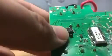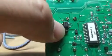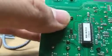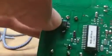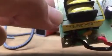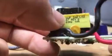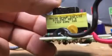Beautiful board. Over here, we have the very, very low power bridge rectifier, and that's just saying they're converting the AC that's coming in over here to DC. Top side, we've got a looks like a pretty standard silicon steel power transformer here, rated for 115 volts, 60 hertz, 1 volt amp, so approximately let's see, that would be 0.707 watts. So this thing's very, very low power compared to a lot of other things you'll find in your house with bridge rectifiers in it.